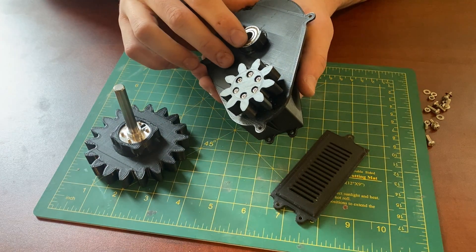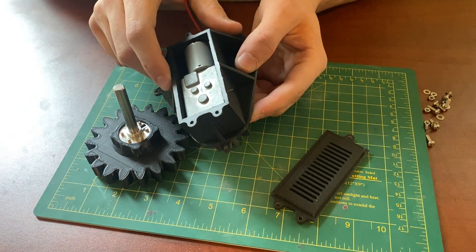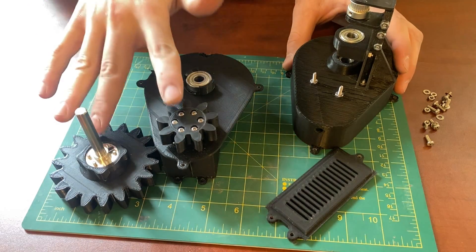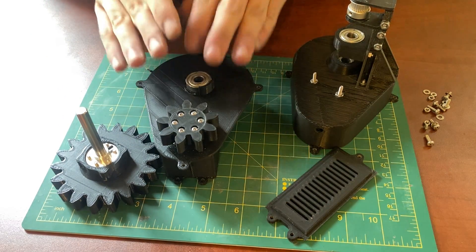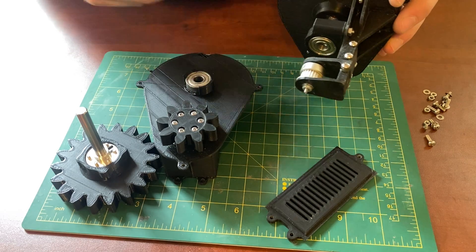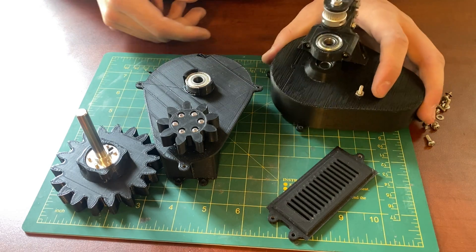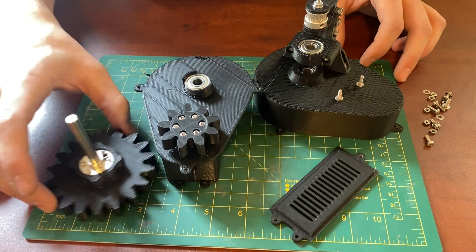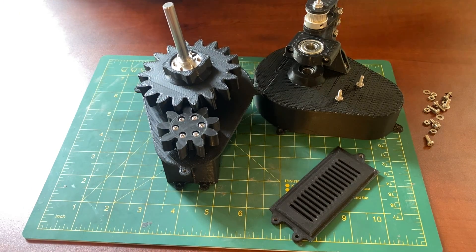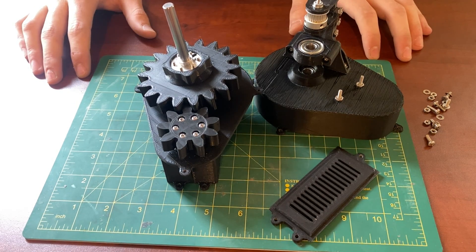The 3D printed aspects are quite simple — it's only two gears. There are a lot more gears made out of metal inside of the motor gearbox. But that is pretty much the entire assembly: the two 3D printed gears, the casing that holds the bearings, the limit switch, the vent cover, more bearings, and this auxiliary structure which was built for a specific purpose specific to the project. It's a fairly simple, well-built gearbox. These are quite oversized gears and they work really well — very strong and sturdy. Thank you for watching, I hope you've enjoyed. This is Levi Sheridan, have a nice day.